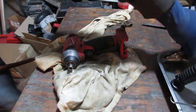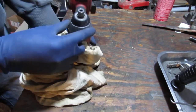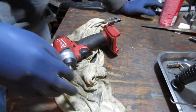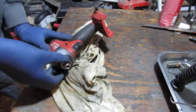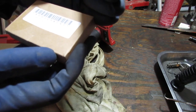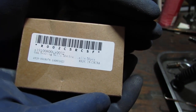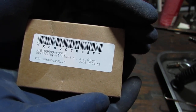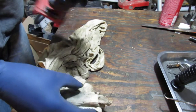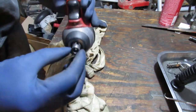The parts diagram confirmed it is indeed four millimeters — I'll put a link to it for you. Here's the ball bearing part number: X002C5RCSF. I'll put a link in the description below so you can acquire it. I have a feeling we shouldn't grease this — just because of the nature of it, I think you want to keep this as debris-free as possible.